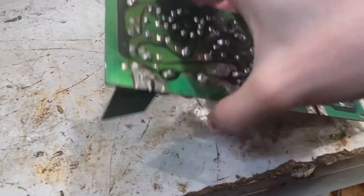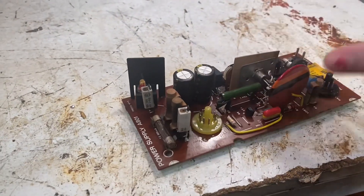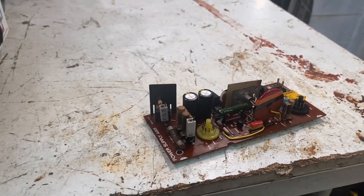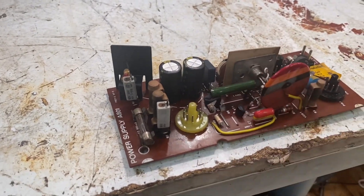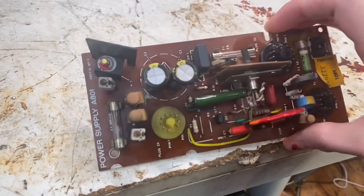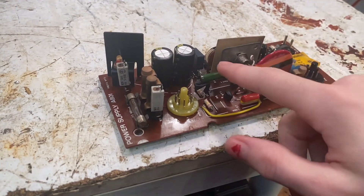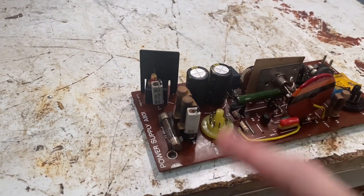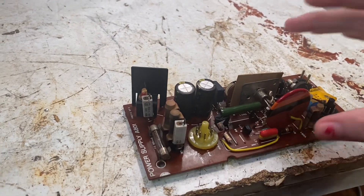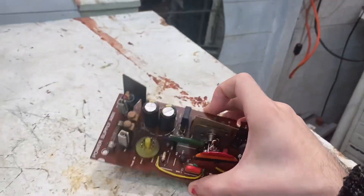I've cleaned up the PCB. I've also changed out the bleeder resistors — there were two 68k resistors in parallel, which made about 32k or so. I've put in a single 33k because that's all I have, and this should be rated perfectly fine. This is for the driver transistor — the switching transistor — so we'll see if that works okay. I hope it does, otherwise it'll be a bit of a waste of time. I want to install this board now and see if the thing works.